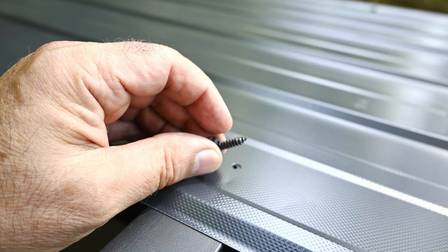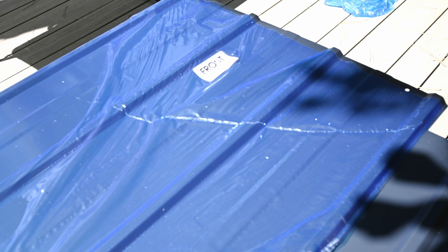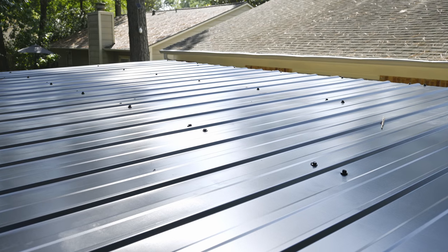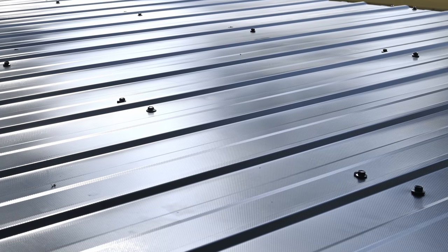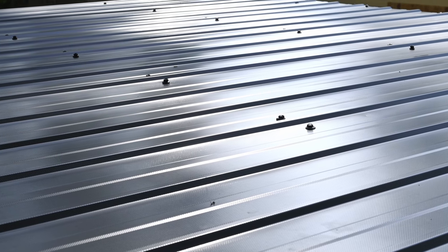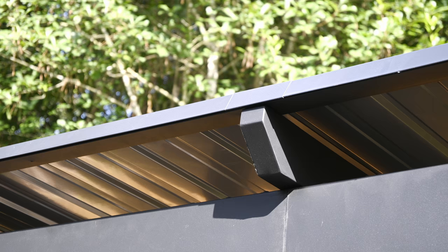You will not need to get on top of the roof, and you should not, because you'll damage it. Do not strip the plastic wrap off the panels until you're ready to place each one — the label indicating the front of each panel is on that plastic. I had to move my ladder twice with each panel to get all eight screw locations. Where the roof overlaps where the two panels join, you may need to drill a pilot hole before driving your screws, as at this point you'll be going through several layers of sheet metal. I used an 1/8 inch bit for that. After you install all the roof panels, you'll think it's done — but you're wrong, there's still a ways to go.